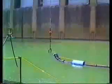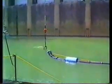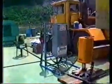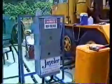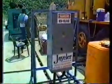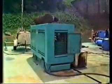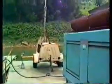Our pump draws about 180 amps. We can use a straight across-the-line conventional starter for this electric powered pump. There's our starter. And we also have a 230 kW Onan diesel generator, and a light pole here so we can operate 24 hours a day around the clock.